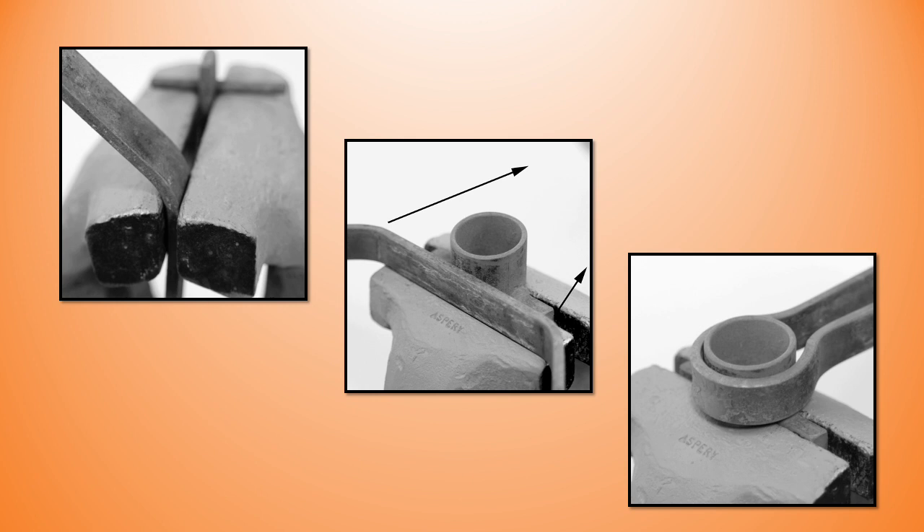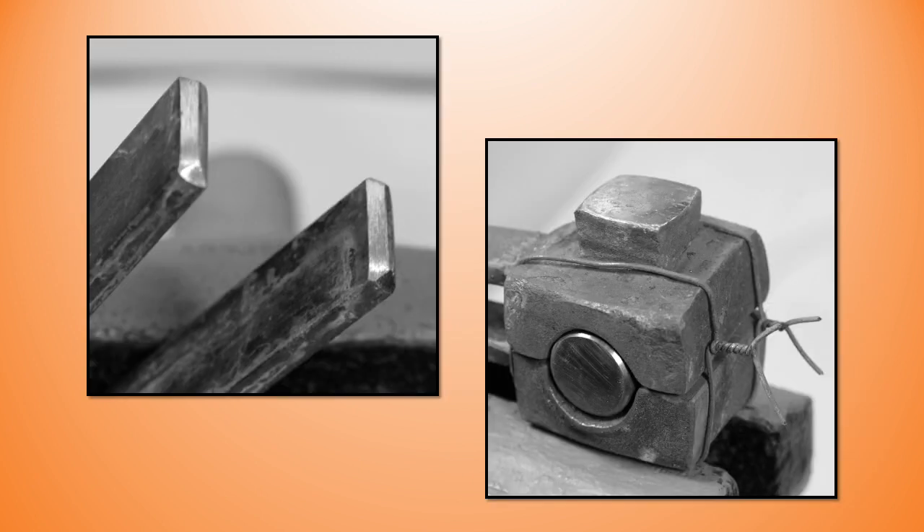I'm going to weld on a spring — my spring looks like a round-ended staple. I use about a 20-inch length of one inch wide by a quarter inch thick flat bar. That's a little heavy for the spring for ease of use; I wouldn't sacrifice the one-inch measurement as it helps stabilize the two tools, but I would reach for slightly thinner material if available. This tool is under a lot of duress — bevel the ends of the staple and preheat the blocks after wiring them together with a blank sandwiched between them before you start welding. You want these welds to be good welds.